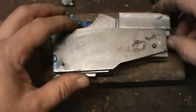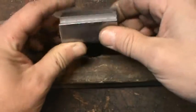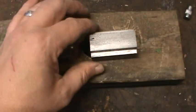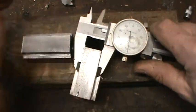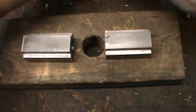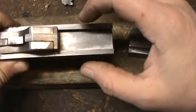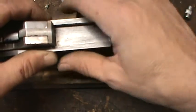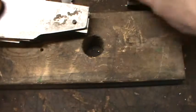I've also made a new receiver block. The reason being that this tenon here on the original — which is right here — was several thousandths too small. I don't know if you can see that or not, but we're down to 740/748, and working with quarter inch material inside here at 748. That would make the plates, if I welded it up, too narrow, and there would not be any freedom in the working action.